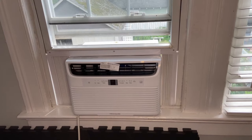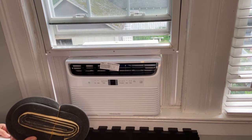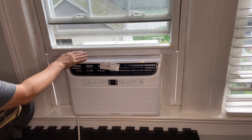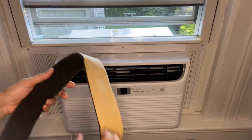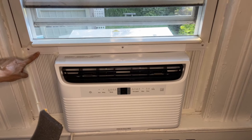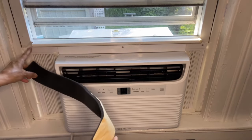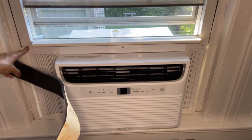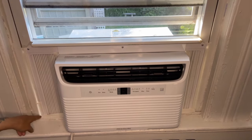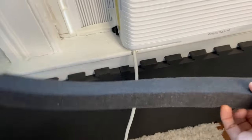That's done. Now I'm going to seal the gaps against any air leaks and insects. I have three different types of insulation strips — I'll put some underneath where I can see light coming through, and also all around the side panel and all the gaps. I realized one strip is supposed to go on top of the top rail where the window sash sits, but it's too late and it's quite tight anyway, so I don't think I'll get air loss from there. I already applied white insulation tape all around the side panel.